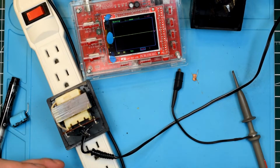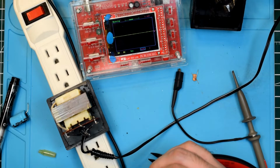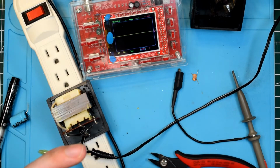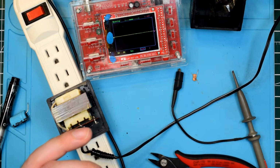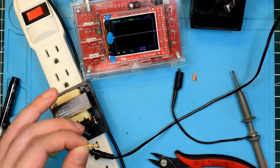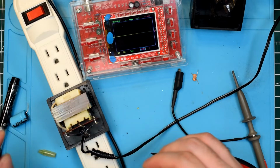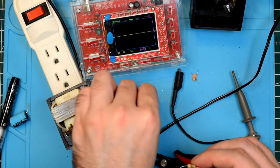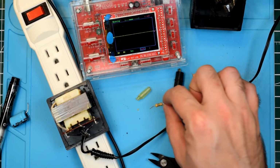So we've now restored the galvanic isolation of the circuit. Let's pull that out. It's probably a third watt resistor there. Yellow, oh, that's yellow-violet-green. So that's 4.7 meg, not 4.1. I thought that was brown, but I guess it looked brown through this yellowed whatever this is. So 4.7 meg resistor there.